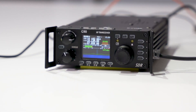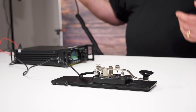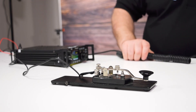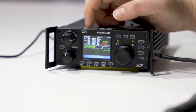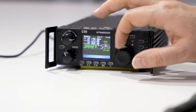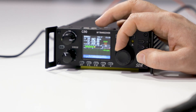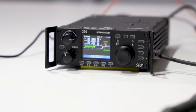Let's power this up and go over to the 40 meter band — that's where a lot of CW is. We're actually going to be transmitting a signal here during the demonstration. I'm going to put this in CW mode and bring it down to the CW portion of the band, which is down below 7.1. 7.097 will work. So we're down in the CW portion of the band.